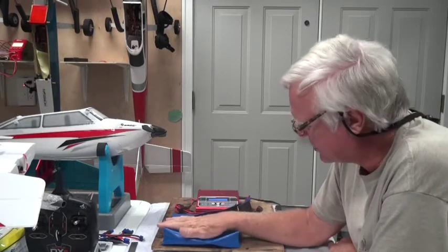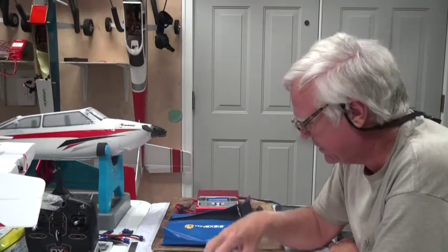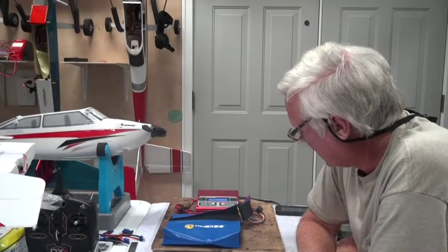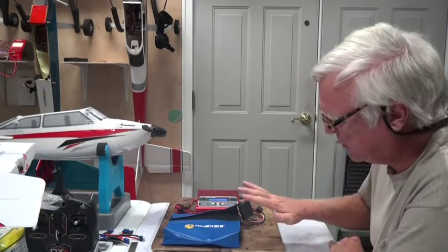I've been doing this more than 15 years and I've never had one go up — never had one even get hot. They'll feel warm to the touch after charging for a while, especially if charging above 1C, and that's okay. Don't let it get hot. Warm means you can hold it in your hand without burning yourself. Charging is an essential part of the hobby; you need to learn how to do it safely and in a safe environment.